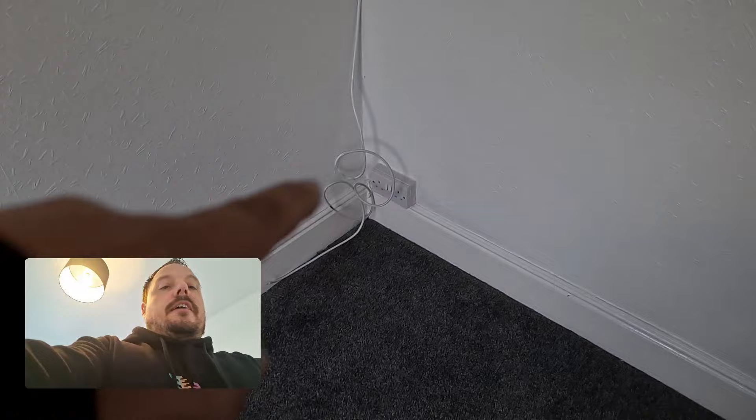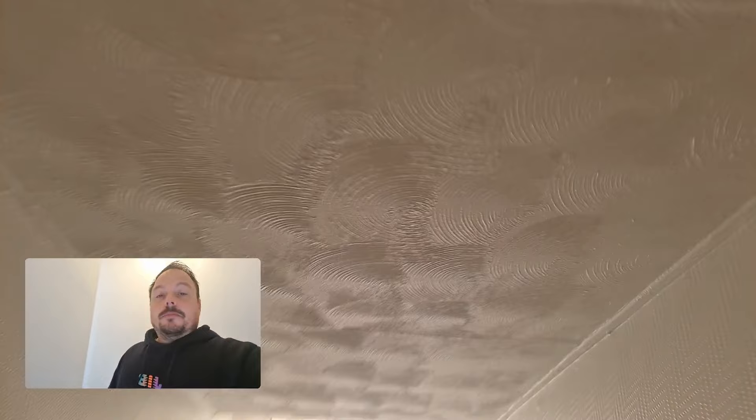Another surface box on there. We've got cables going off, although that is an aerial cable rather than a power one. There's not a great deal of accessories around the place. The short on sockets is indicating the wiring of an age where it's maybe time to be thinking about a rewire regardless of its condition.